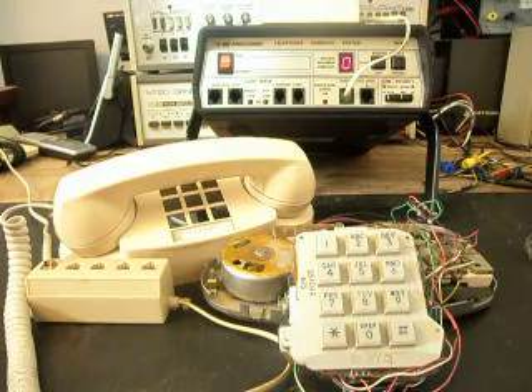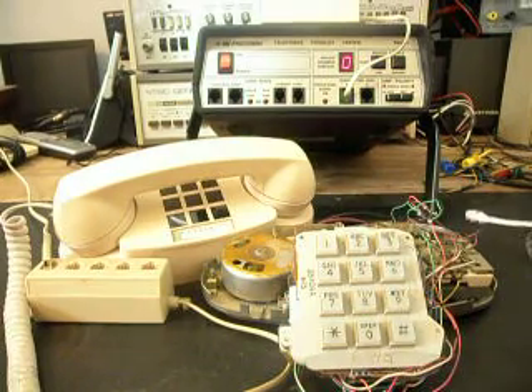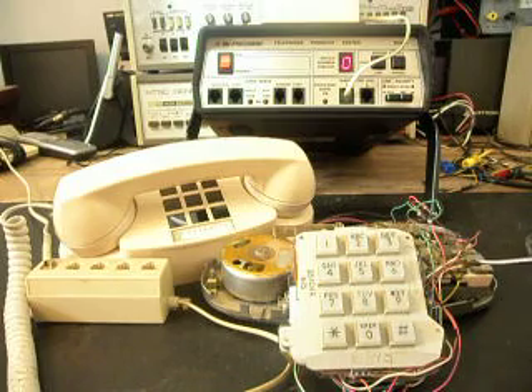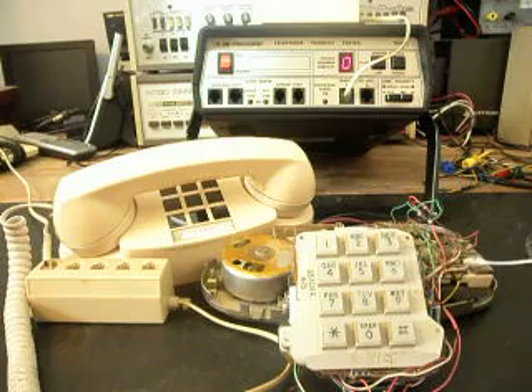We did an initial checkout video of this telephone. Basically, Norman was watching some of our videos and figured that maybe this telephone needed a bridge rectifier, since the only thing it wouldn't do was dial out. Somebody had already changed the tip and ring polarity on the network, and that didn't work, so they gave up. It wasn't a polarity issue — it was really the keypad.